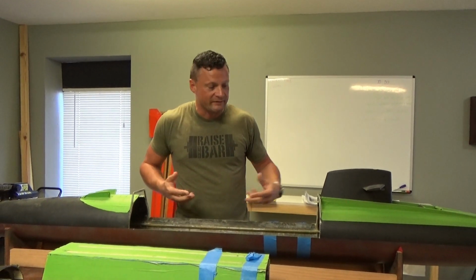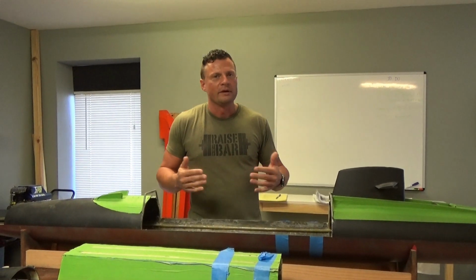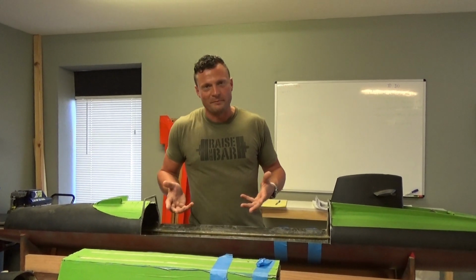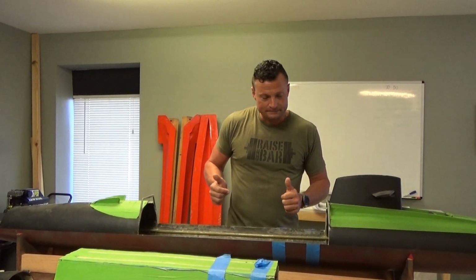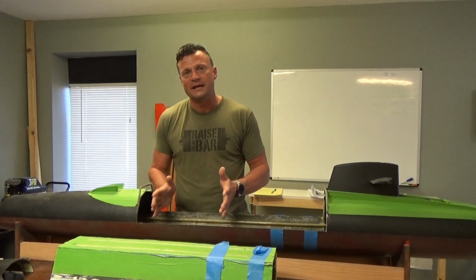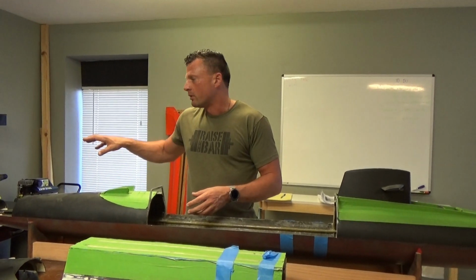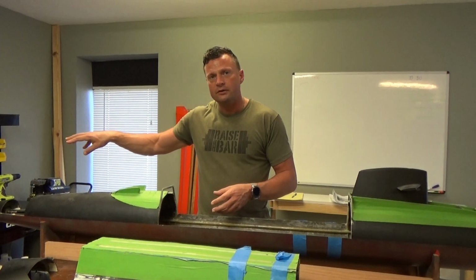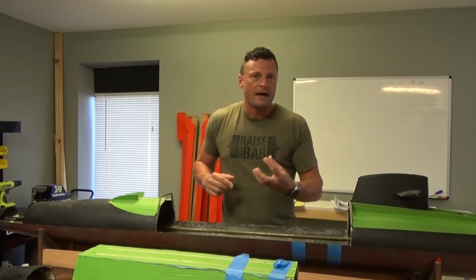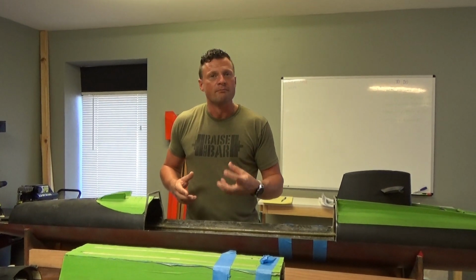And again, the beauty of having so much room, you could literally rig them up in parallel to have 20 or 30 or 40 amps of capacity if you wanted. In the center you have your ballast tank, and in the back you would have your drive section. And that drive section would basically house servos for your rear dive planes and your rudders, as well as your main drive motor. And in this particular case, I would go with a really big, beefy, brushed motor.